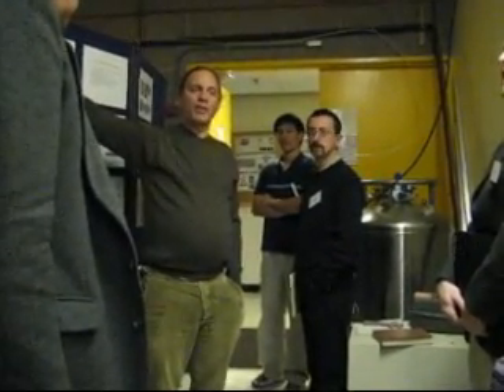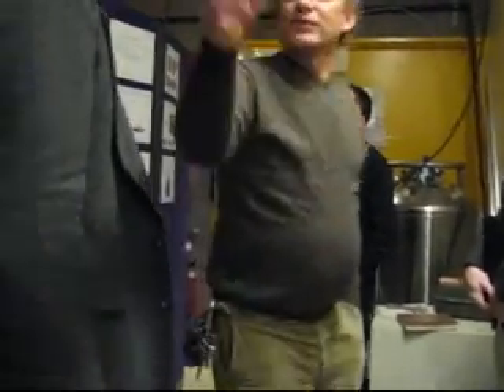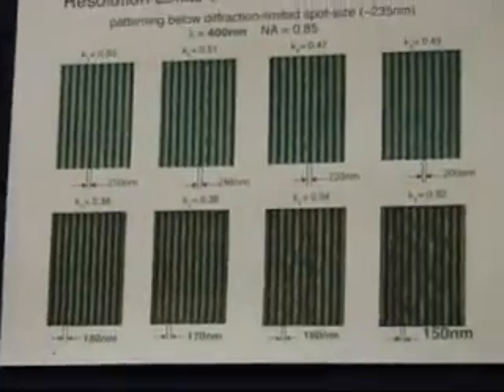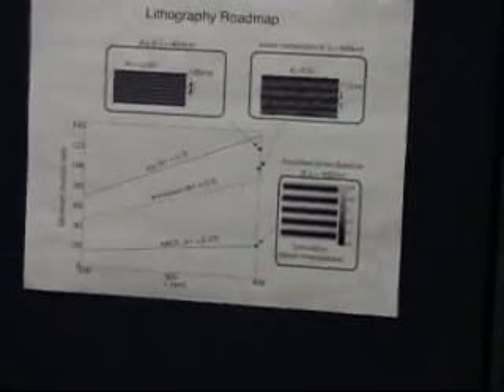On this side is the zone plate array lithography system, which was going to put e-beam lithography out of business. This is a large array of zone plates which focus light of arbitrary wavelength — anything that passes through atmosphere — down into a bunch of little beamlets. It has very nice k-factors, and you can see some very fine-pitched gratings here using 400 nanometer lambda light. We envision a system with around 1,000 beamlets, though currently it's on the order of 16. It's a big data handling challenge, but you can get quite amazing throughput and small feature sizes. It would be useful for prototyping, or for a mix-and-match approach where you do one step with small features over a large area.